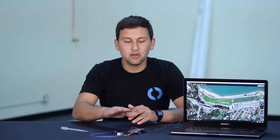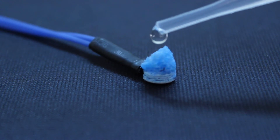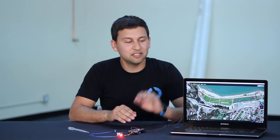The probe tips are also available and easy to replace in the field. The leak sensor is already supported in ArduSub and quick to install on the BlueROV2. I've got an SOS leak sensor with a single probe, with a Pixhawk Autopilot running ArduSub connected to QGroundControl on this laptop. With this pipette I'm going to put a few drops of water on the sensor. Check that out — the LED turns on, the Pixhawk recognized it immediately, and QGroundControl is giving us a warning of the leak.